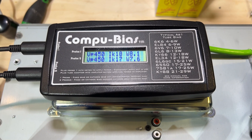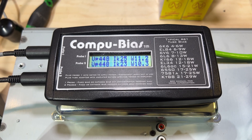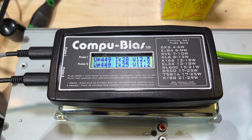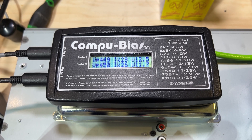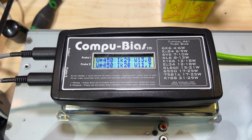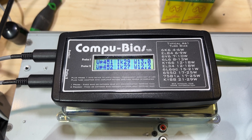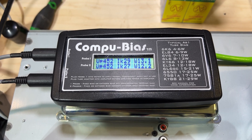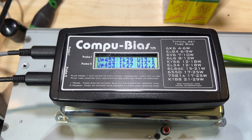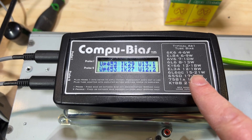I can see our watts there. I'm going to be ready to turn the amp off if that idle current goes way too high. I've already tested these tubes, but if we have a shorted tube you'll see that current just start to really move up — and that's where an analog meter can really pay off for doing these initial startup tests. I'm holding the camera with my left hand and have my right hand on the power switch just in case. We're looking for 15 to 21 watts for the 6L6GC.